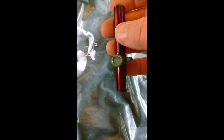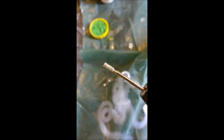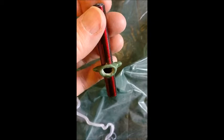I basically drill a hole and then use a small grinding tool or an engraving tool and just patiently grind away. The Dremel is wonderful for most things. You need one of these flexible shafts. Flexible shaft, I should have said, not a flexible cord. And the job proved easier than I thought. Still took about 20 minutes, drilling a hole first, this time with a sharper bit, and then using that particular tool to grind away and make the hole larger and larger. And that's the result. That's ready to be painted. I shall paint black inside the hole, and then the rest of it is going to be painted the same bronzy colour to match the outside of the periscope.